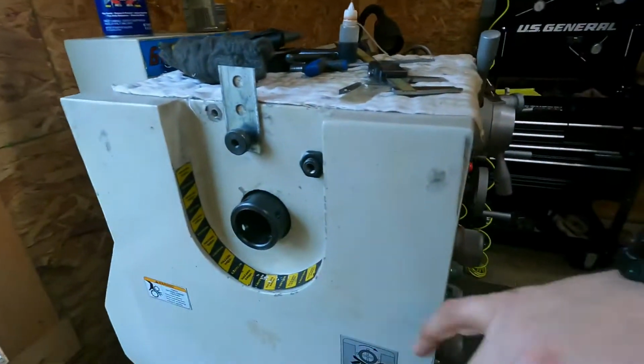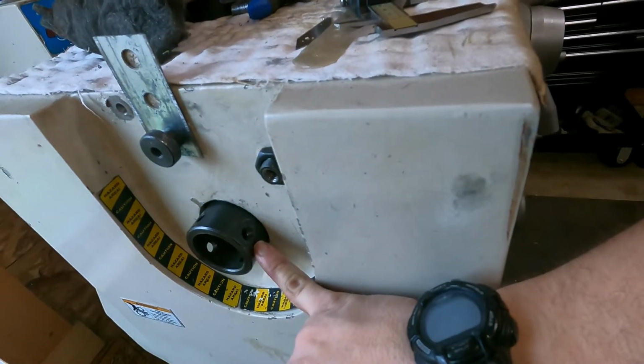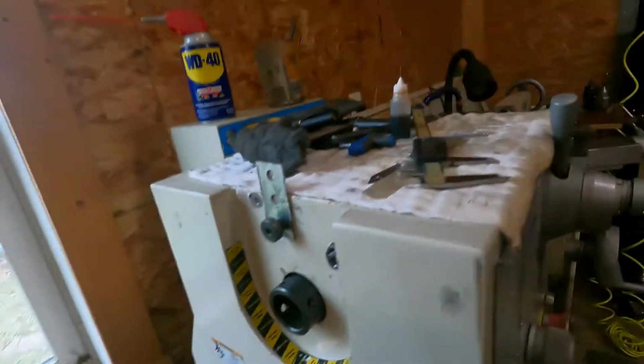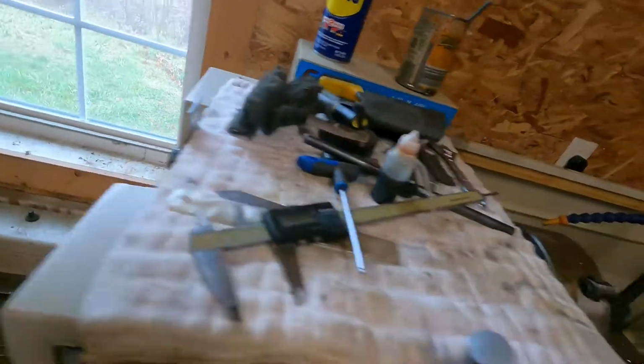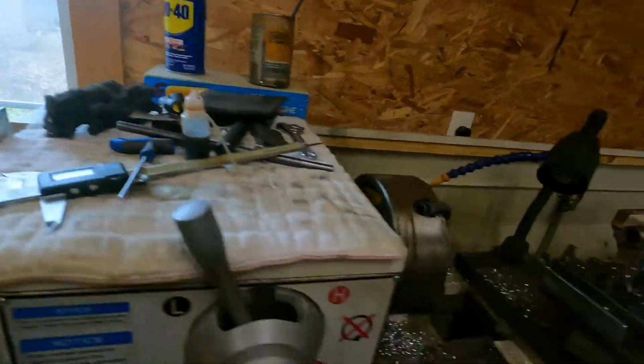So I've already gone over my lathe. I've got a Grizzly G0709 14 by 40. This is their gunsmith special. The thing that's gunsmithy about it is it's got this spider spindle here with a 1.5 inch spindle bore. So I've got some bolts I can put in here, and it essentially acts like a 4-jaw chuck and allows me to tip and manipulate the barrel.